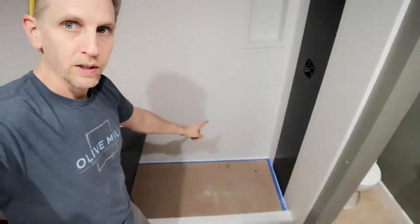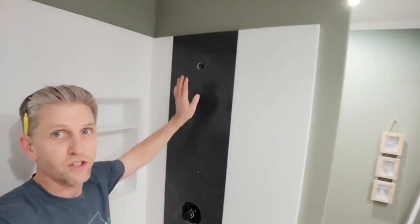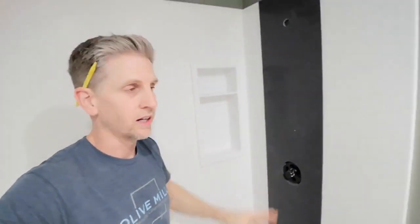It's just a quarter round, and then we have to silicone it. We'll clean up the cardboard, and then the plumber will come in and take care of the faucet and the shower head, and that is all done. So if they want to do some painting or whatever, they're more than welcome after we're done. But at least our part of the project is finished and should be a waterproof shower. So let me get started on the quarter round and the siliconing.